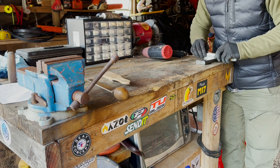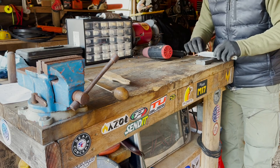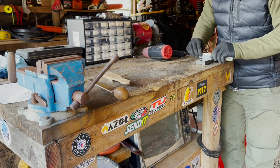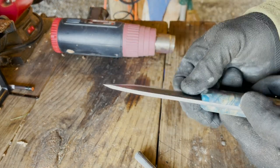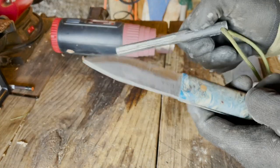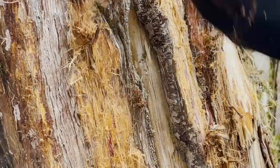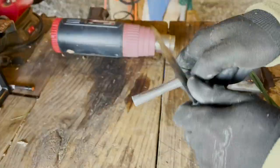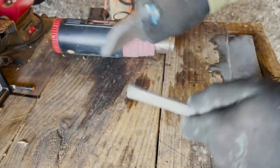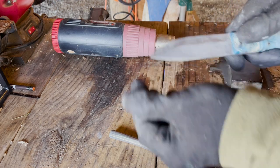I spoke with Garrett, the owner of the company, on the phone — a super nice guy out in California, out in the desert, close to where I actually used to live. He's probably not pleased with how I'm treating his blade at the moment, but that's okay. This whetstone is actually working much better than the file for getting it back into shape — it's cutting the steel better. A file might be half wore out; I tend to get my money's worth out of tools, use saw blades until they're absolutely destroyed. Every now and then just dunk your whetstone back in the water to give it this slurry effect. You don't want to use a dry stone because you'll fill up the stone with metal material and then it won't be coarse enough to cut. I could spend all day polishing this thing, but all I need the back to do is scrape some tinder off some tree bark, and if it does that from both directions regardless of which hand you're using, then it's good enough.